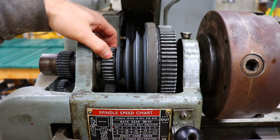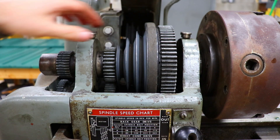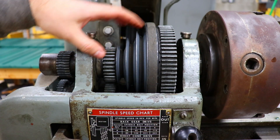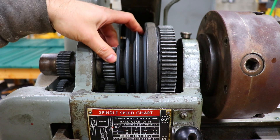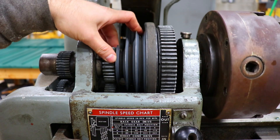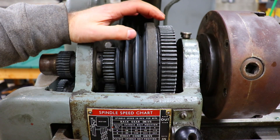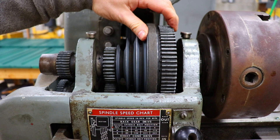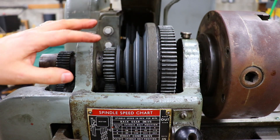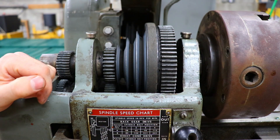These gears are made of Zamak — a zinc, aluminum, magnesium, and copper alloy. If you maintain them well they hold up pretty well, but they can be fragile compared to steel gears. As you can see, it snapped off — it's not supposed to spin freely like this. I was able to source a pulley and gear assembly off eBay, so part of the restoration will be removing the spindle, taking off this old pulley-gear assembly, and replacing it with the new parts.